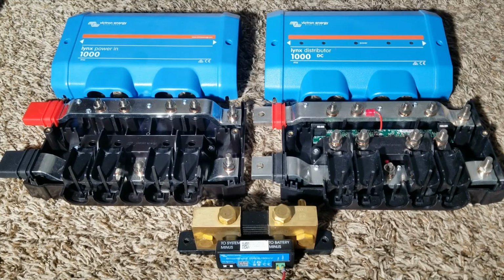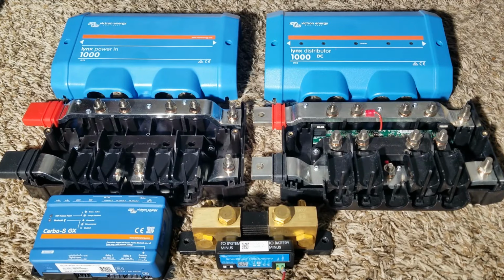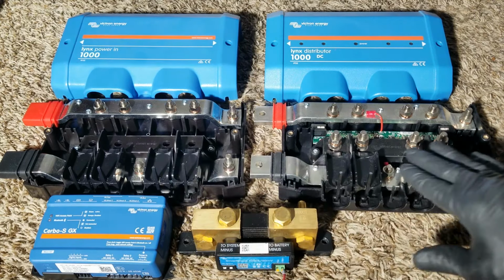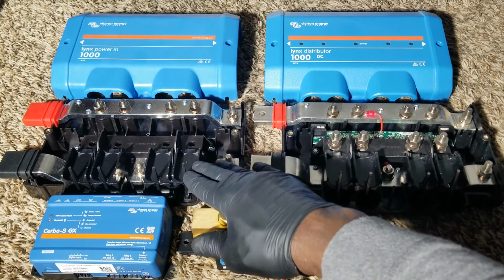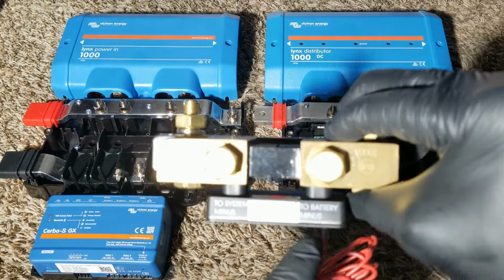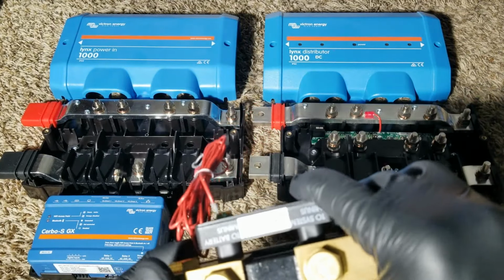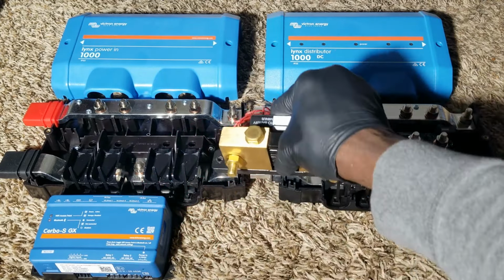So these are all interconnected to make a very manageable system. These components work together in conjunction with each other to make a modular system. The shunt comes after all the batteries and all the equipment. This one comes in between to make sure it reads everything that comes from the batteries. What's coming in goes to battery minus. So if you go like this, battery minus, and it goes to system minus, it's just like having this guy in between here.